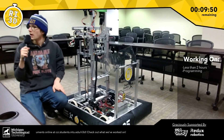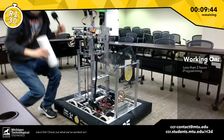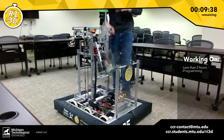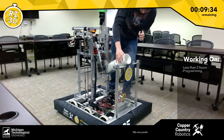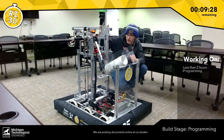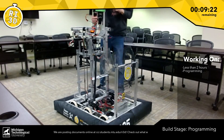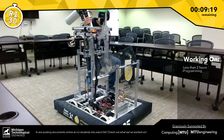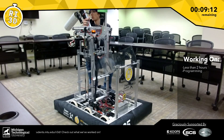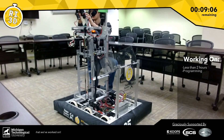That leads to game piece manipulation and how the robot handles interacting with the game piece. This right here is our intake — it's basically just a couple of wheels that spin to suck in the pipe. Once the coral is on the robot, the arm can swing back around to score it on the specific scoring spot. But for level one, that would be an unoptimal way to score, so we added this pivot here which will pivot the coral off to the side.